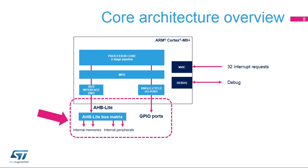The Cortex M0 Plus has neither a cache nor internal RAM. Consequently, any instruction fetch transaction is steered to the AHB Lite interface, and any data access is steered either to the AHB Lite interface or the single-cycle I/O port. Note that the STM32G0 implements a SOC-level cache external to the CPU. The AHB Lite master port is connected to a bus matrix, enabling the CPU to access memories and peripherals.